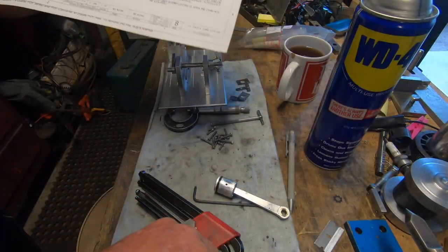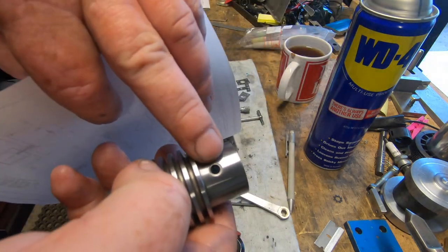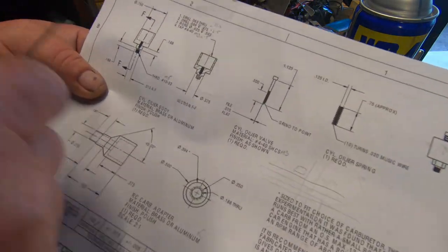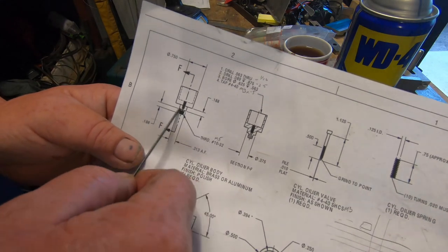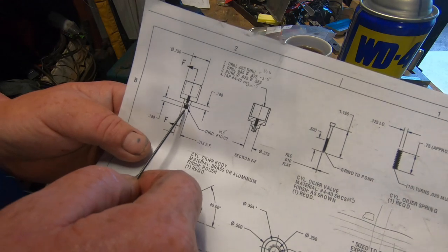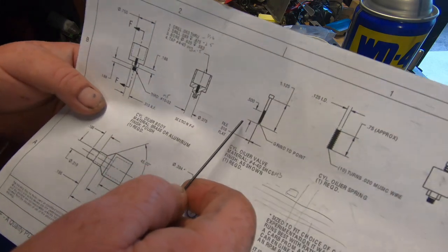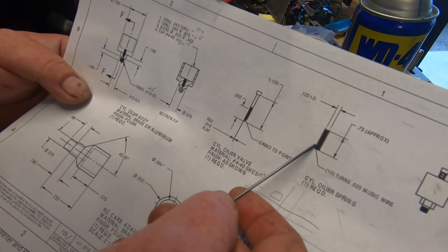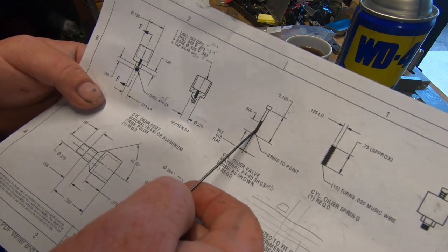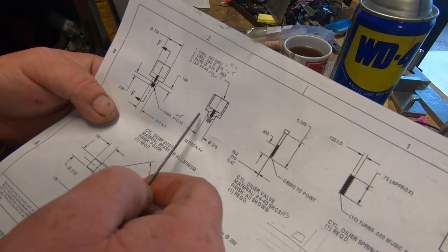So I'm gonna make the oil cup that goes in the cylinder. It's only 3/4 inch diameter. I've gone for M5 thread into the cylinder instead of 10-32s. Hopefully I've already got a spring that'll do the job here, and just a 3mm bolt. I'm just gonna get in and build it on the lathe.